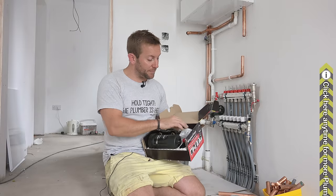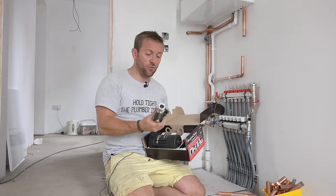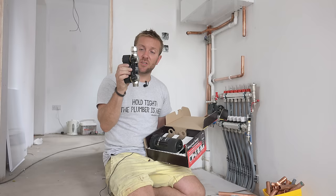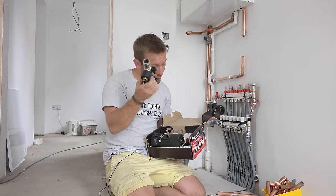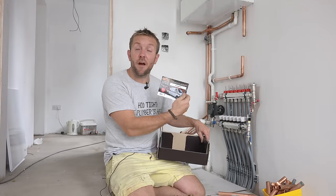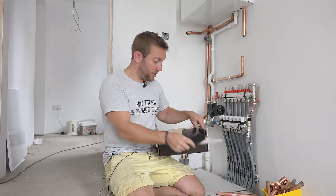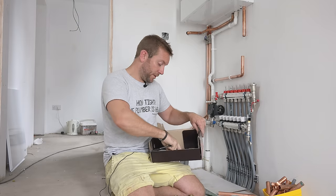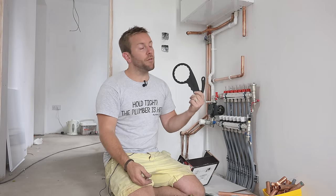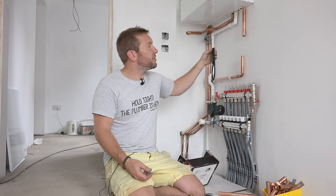What do you get in the box? You get a nut and olive for one end, and also protection caps if you've got it orientated a certain way. You've got your actual little manifold that goes on as well, with an alignment tool on there. We've got our little holding clip, and obviously then we have our MagnaClean itself. Don't put the removing tools in your van and run off with them — leave them here on the job, because someone else or even the homeowner is going to come along and try to do the work, and they're not going to be able to do it because the tools are in your van.